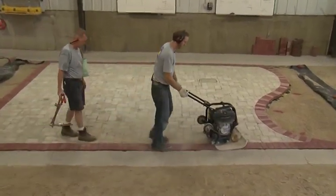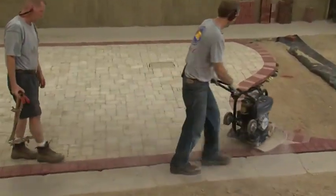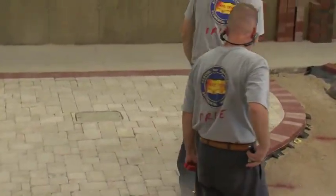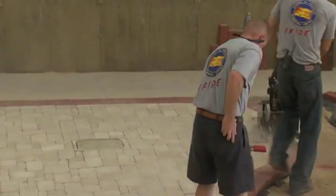To begin the interlock between pavers, it is important to do an initial compaction before filling the joints with sand. First, start around the perimeter of the project and then work back and forth going up the elevation.